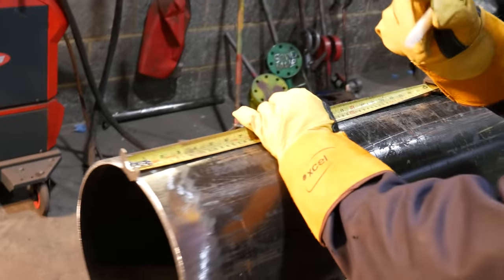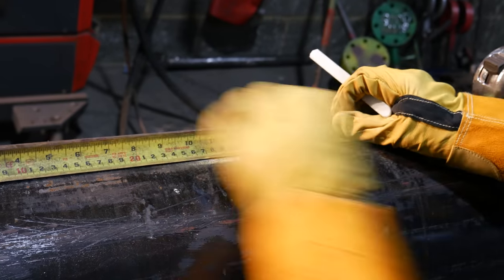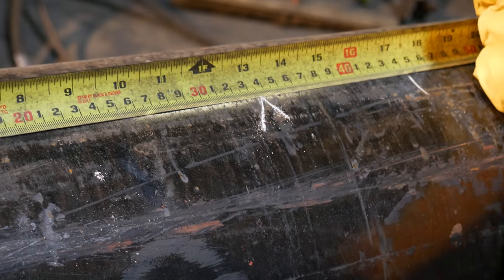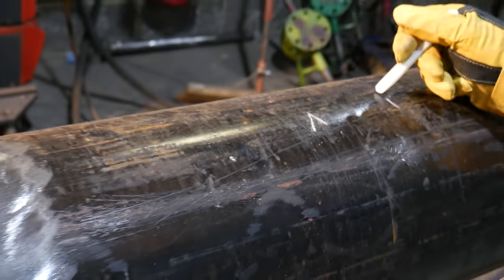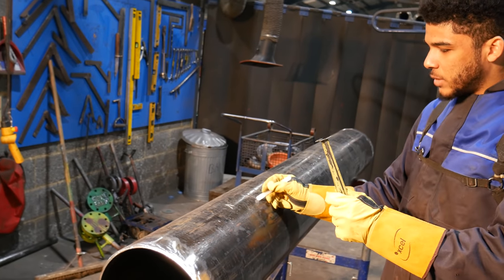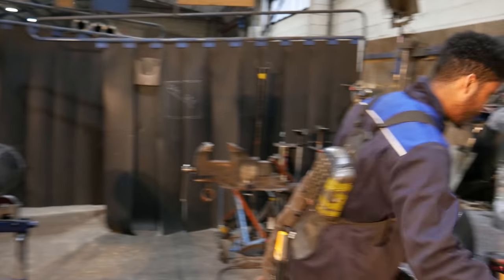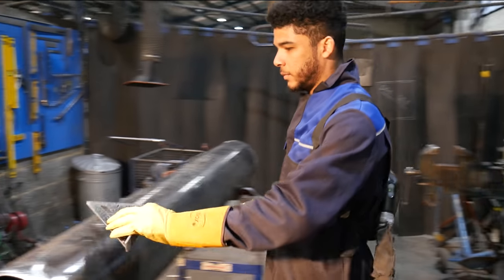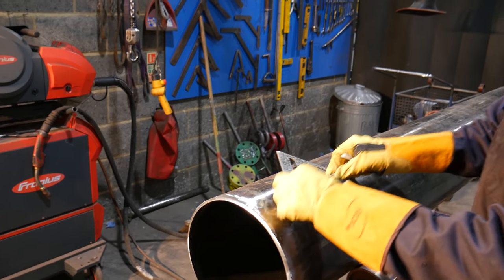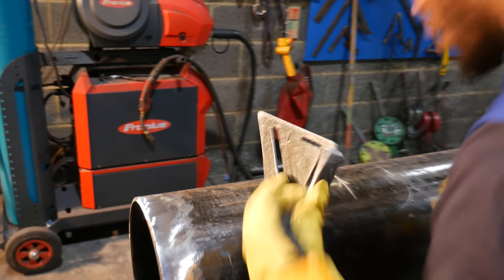335 mil. Now, there's a technique — always do a V when marking. Anytime you're marking, always do a V. For example, if I do a straight line it's never exactly straight, so when you come back to mark it you forget exactly where your mark is — is it the top, is it the bottom? So your measurements can move all over the place. Always do a V with a speed square so that this edge here lines up perfectly straight.